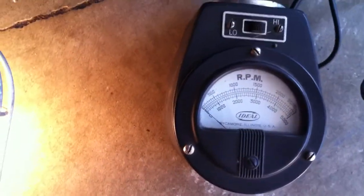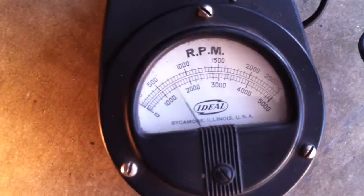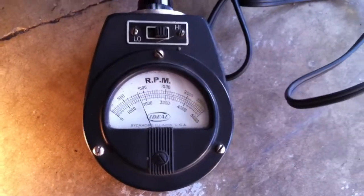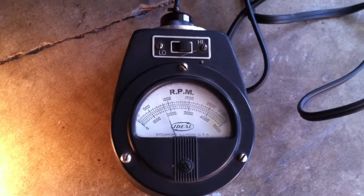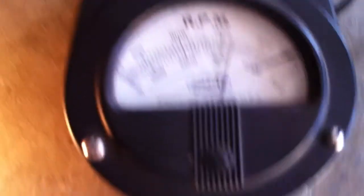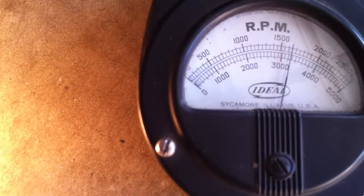I didn't have the rubber tip on there properly last time. So let's try again. That got about 2,600, I'd say. You can see how bright the light flashes when it transitions back and is momentarily an induction generator. We could probably have just about had that on the low speed. See, that meter's maybe off a little bit — that should be showing 1,800 rpm, or almost, with no load on it.